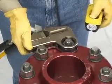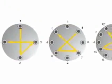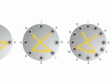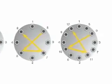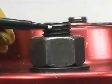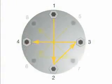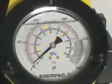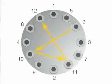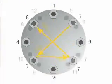Stop the pump after the work has been completed. When torquing, it is common to tighten only one bolt at a time, which can result in point loading and load scatter. To avoid this, torque is applied in stages following a prescribed pattern in four steps. Tighten the nut spanner tight, ensuring that two to three threads extend above the nut. Tighten each bolt to one-third of the final required torque following the star pattern as shown. Increase to full torque on the third pass, again following the same pattern as used in steps one and two.